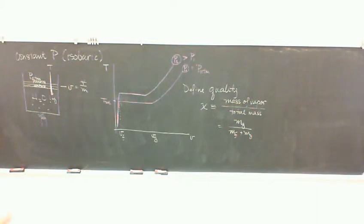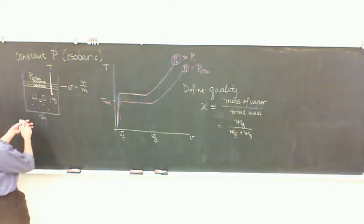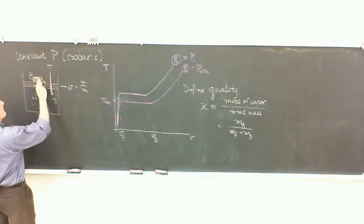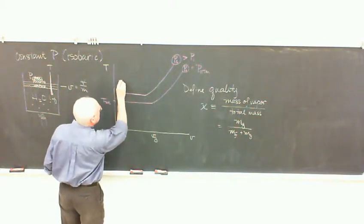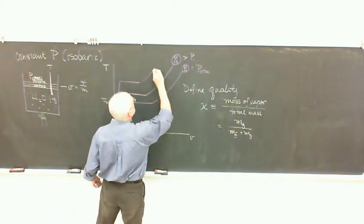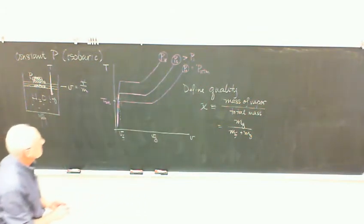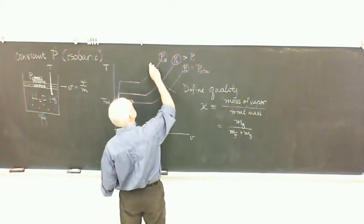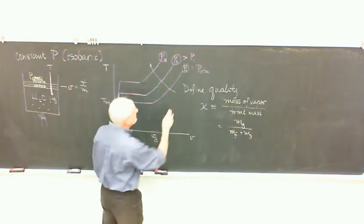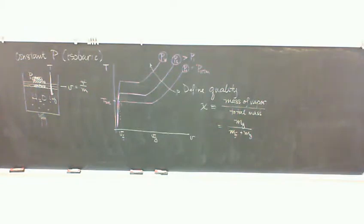And at any point, again, if we turn it off, we come right back down that line. So we run it again, put a little more mass on there, run it again, and the same kind of thing happens. So there's P3. And this is the direction of increasing pressure across those lines. So that's another way we designate this kind of thing. We put an arrow across those lines saying that's the direction in which the pressure's increasing.